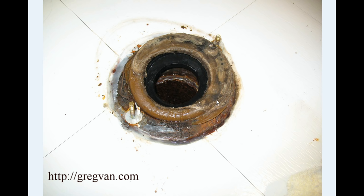This problem is usually caused from a toilet that rocks back and forth. Eventually, if it's moving, it will flatten one side of the ring a little more than it should be, and this would create a gap.